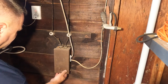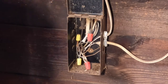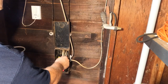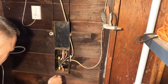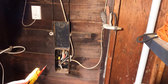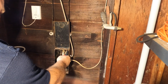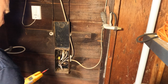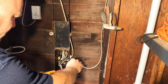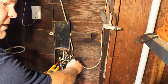We're going to rip out all the old knob and tube and replace it with a couple of new ceiling lights, new garage door receptacles, and replace the old disconnect fuse box with a junction box for an on/off switch. We'll also put in two switches — one for the overhead lights and one for the outside double flood — plus a GFCI convenience receptacle. But first, I want to open up and see what's behind this box. Before I do anything, I want to make sure I have 120 volts hot to ground and 120 volts hot to neutral, so I know the new stuff will be wired correctly.